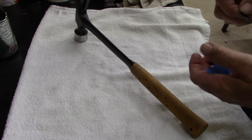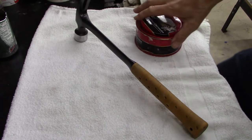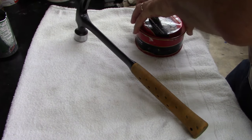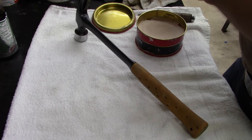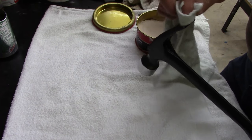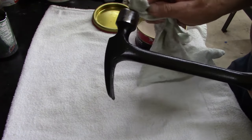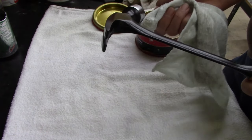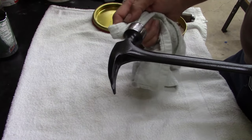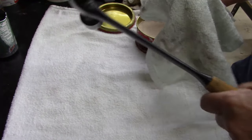22 ounce. I'm almost positive it is a Bostitch. And I know back in the day when they sold these, I don't know if they still make them, I haven't even bothered looking, but before when I was looking, they were like $104 or $107. So definitely a good hammer. I mean, they're just a knockoff of an Estwing. This one doesn't have a waffle face, it's a smooth face. This would make a good hammer for someone doing cabinet work, trim work, or sheetrock work.